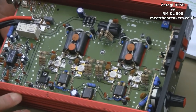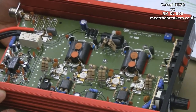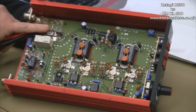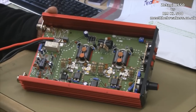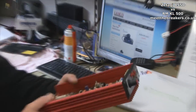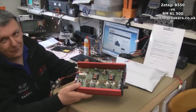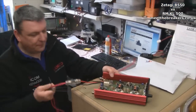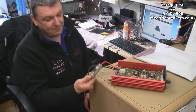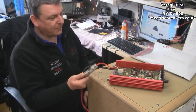The only thing is: don't drive these things with more than five watts. This one will do 200 watts as it is; you could push a bit more and get up to 300 watts, but the fuse holders burn out and just give way. The heat sink could also do with more coverage — if you're going to use one of these, please use it with a fan. I've beefed the fuses up at short notice — it's a bit big but it'll stop it going bang.